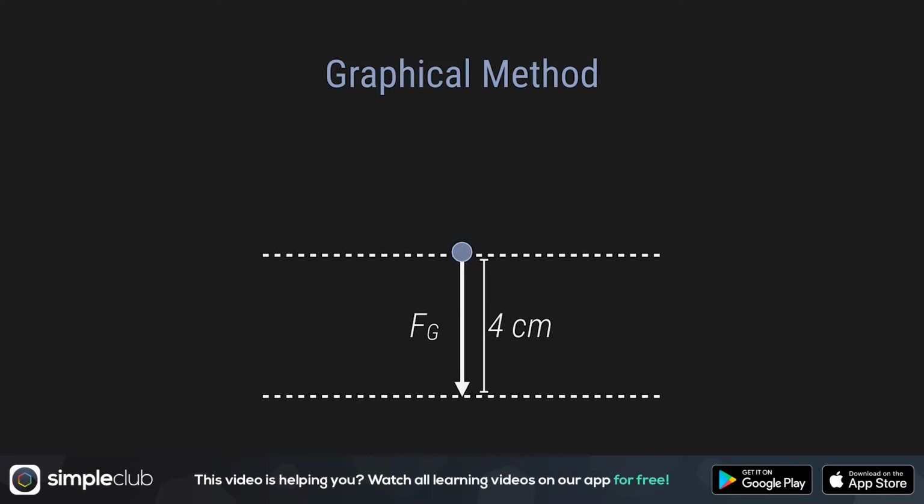Unfortunately, we don't know the lengths of S1 and S2 yet, but we do know their angle. So for now, we're going to draw their lines of action only. Starting with S1. S1 makes an angle of 40 degrees with the x-axis, so we draw a slanted line of action through the tip of our Fg vector. And for S2, we know it's slanted at a 40-degree angle to the x-axis as well. The trick is that we want to reach a force equilibrium, which means that all the forces have to lead back to the starting point. So the line of action for S2 needs to lead right back through the point we started from.